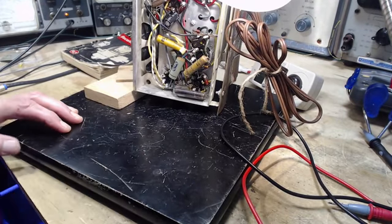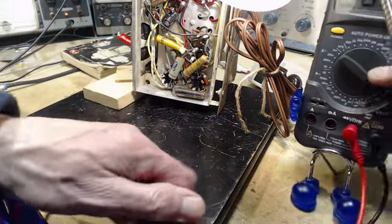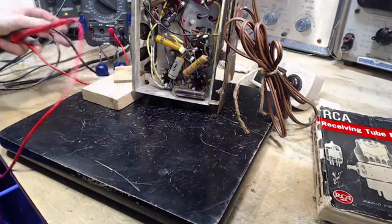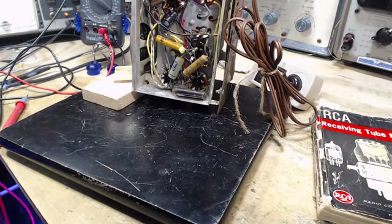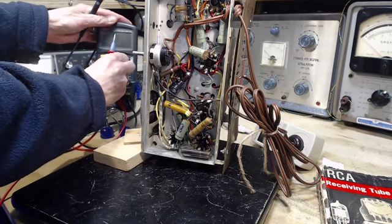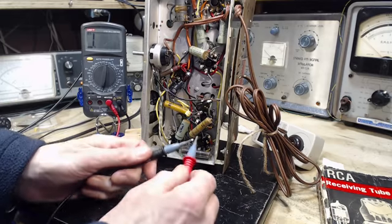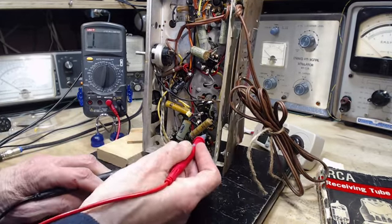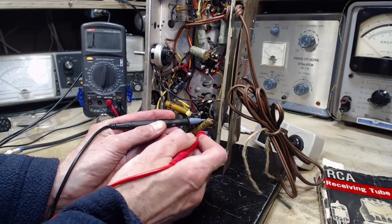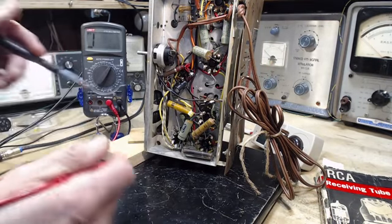Is that open? Is that open circuited? Voltmeter. Okay. Ohmmeter. Meter of some sort. Let's try to get everything in view here. Okay, did we find an open resistor? Where's the lead? Cool, I can get it right there. Got one right here. My Jove, it looks open, doesn't it? Go higher. 200 million ohms.